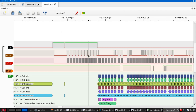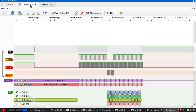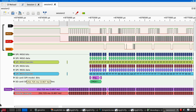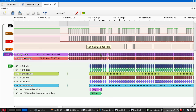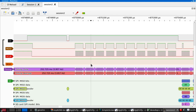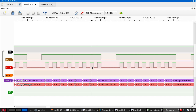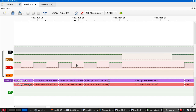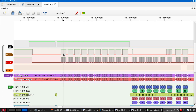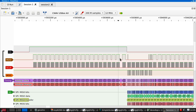Interesting. Well, anyway, let's compare with what we are getting out of the Arduino code. So firstly, the clock timing is 250 kilohertz, which is similar to the 320 that we're using here. This is sending 10 bytes of sync pulses versus our 20. That's fine.